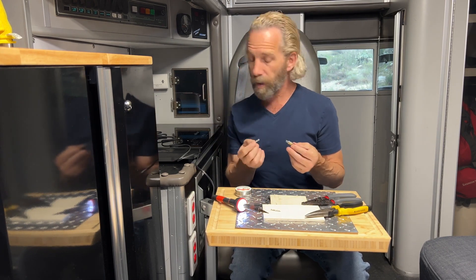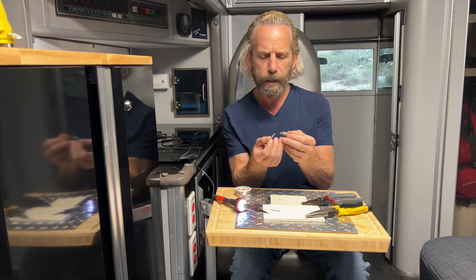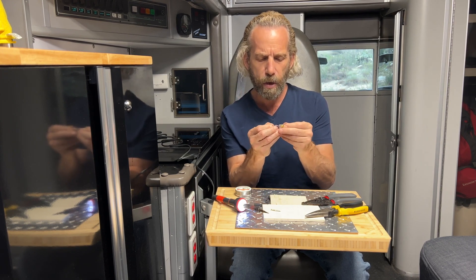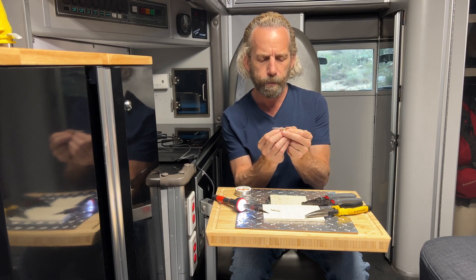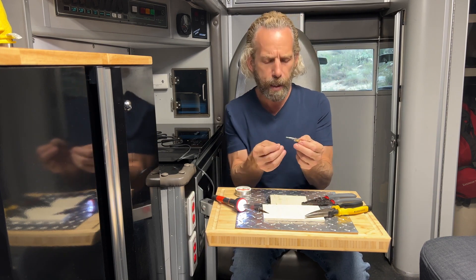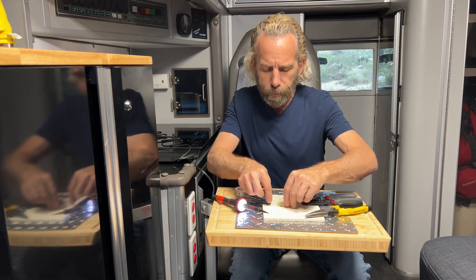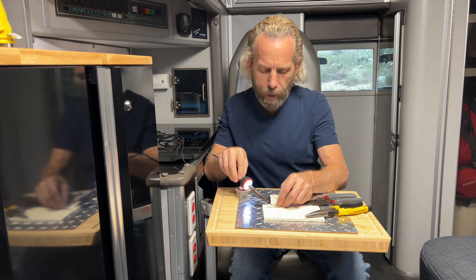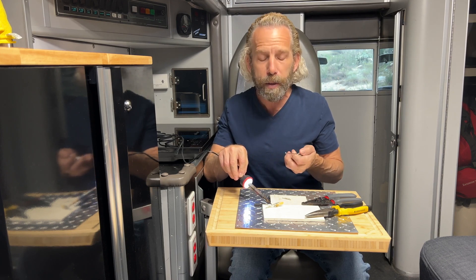I actually have it plugged right into the ambulance right now. I've taken the liberty of kind of crunching over some of these things to make it a little bit snug. On the pin, you'll see them kind of go in — you got to kind of encourage it after I kind of bent it over a little bit on the little ends. I have some heat shrink that I'm going to put on after, just kind of loosely — I'm not going to heat it up. But essentially, that's what you do. You're going to slide on one, and then we're going to hold the soldering iron in there. We want to get that nice and warm, and we're going to have to wait a minute or two, then put some solder in there.